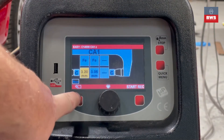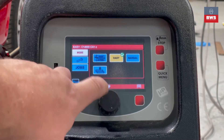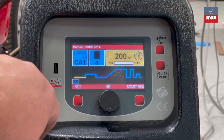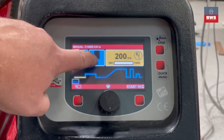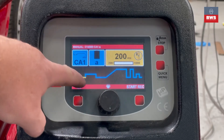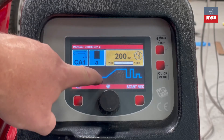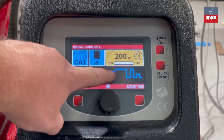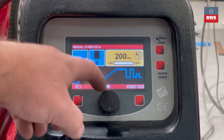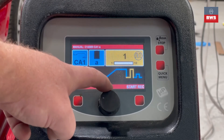Pressing the back button again and back again. Manual Mode allows us to change all of the parameters in the weld — this is like a professional mode. Here we can specify what arm and what tip we're using, and if we're using a different tip shape. We can also go through the synergic program — here we have a pulse weld, which is your first little preheat weld, then a gap before a slow pull, and then we go into our pulse weld.